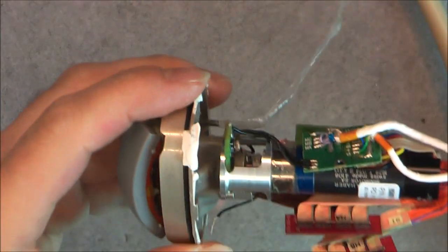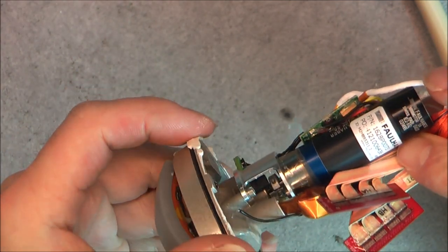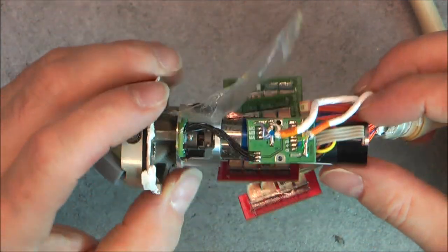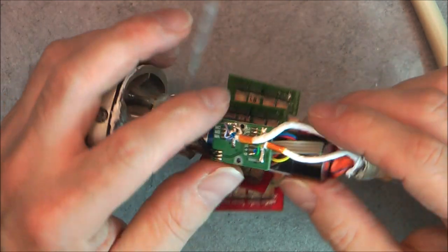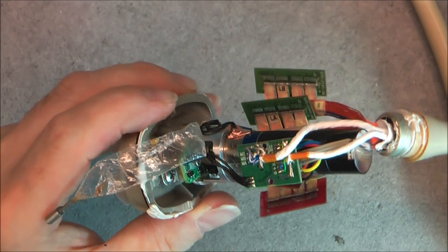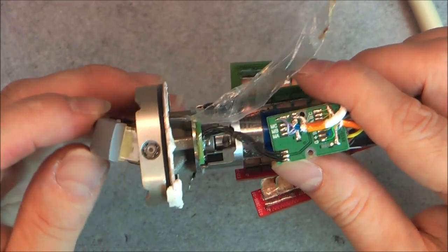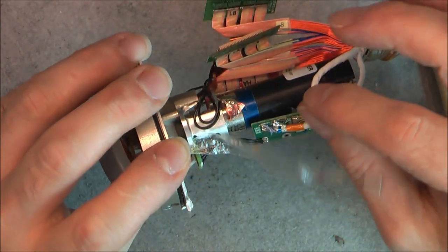So, obviously, a very nice motor by Faulhaber brand called Mini Motor. Swiss made. This might be a date code. Looks like the connections to the motor. We might have a speed or position pickup here on the main connections. All made here on this little relay board. Also with the grounding. And I just noticed here one extra board. Might be a position sensor for the head. Yes, seems to be a Hall effect sensor here. Hall effect sensor. Grounding everywhere. Our little empty reservoir of grease.